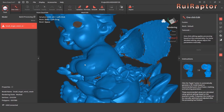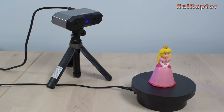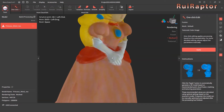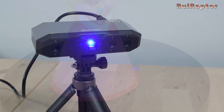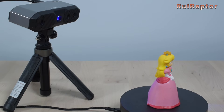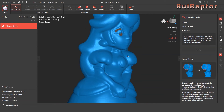The Mini 2 is equipped with a camera to capture texture, unlike the first Mini, which was not. To test the color camera, we chose this model. After the scan and the data processing, this is the result. Although it was able to capture all the small texture details, the color, however, is not very accurate. The vivid pink skirt is now a faded, almost orange color with a pattern on it. This pattern and difference in colors is the result of the blue scanning light on the model's surface. The Mini 2 is designed mainly for scanning small models and capturing them with increased detail rather than capturing colors — color is more of a secondary feature. If we check the mesh data, on the other hand, all the true details are there. The missing areas on the eyes are the darker areas that the scanner naturally has more difficulty capturing.